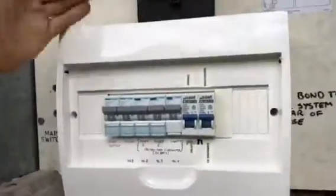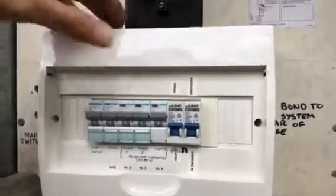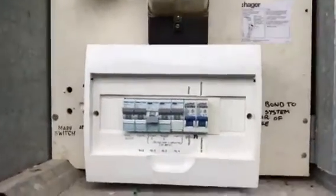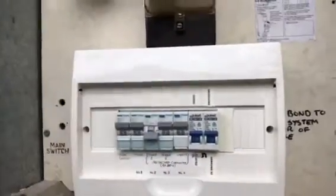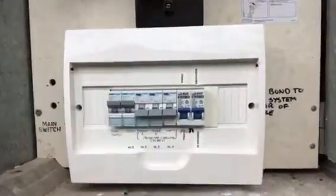The beauty of having RCBOs on each circuit is that if you have a fault in your switchboard or in your house, you're only going to lose that single circuit itself. For instance, say you've got a fault on power circuit one — you only lose that single circuit. In older houses, they actually share a safety switch covering, say, two power circuits and a light circuit. So you may end up losing all your power and all your lights from just one issue.